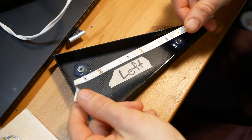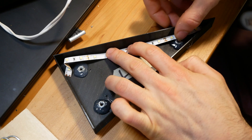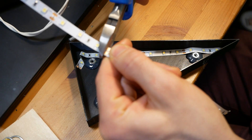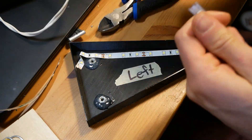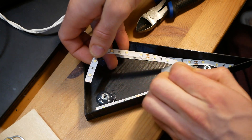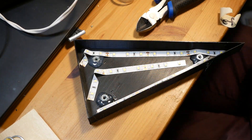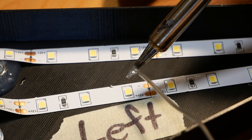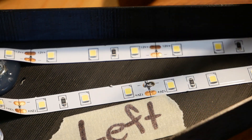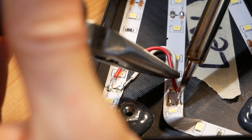The sign is illuminated with stick-on LED strip lights. These are all over Amazon, but I'll leave a link to the ones I used in the description. These LEDs are bright daylight white and they come with a dimmable AC power adapter. They're great for making light-up signs because you can cut them to any length along the marked areas, fold them around corners, and use the adhesive backing to stick them to your piece. Then you just have to solder the individual strips back together in parallel.